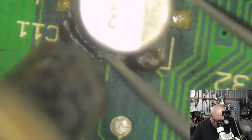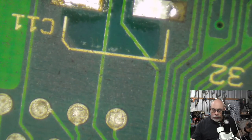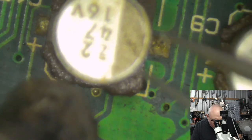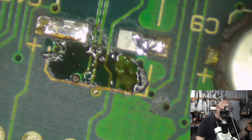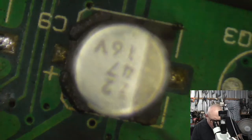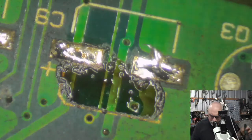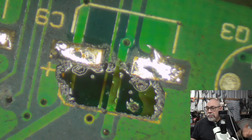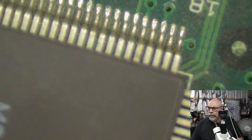But these days, if you want to buy yourself a math coprocessor chip, it is a Motorola 68882 FPU, and you need to buy it in a PLCC chip carrier, which stands for plastic leaded chip carrier. They're very, very cheap. I bought 5 recently for, I don't know, geez, it was probably less than $20. So if you're wondering what advantage you get from having a floating point chip in there, probably none. But with them being so cheap, why not put them in? Why have a gap on your board? That's what I say.